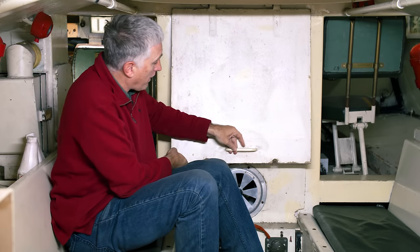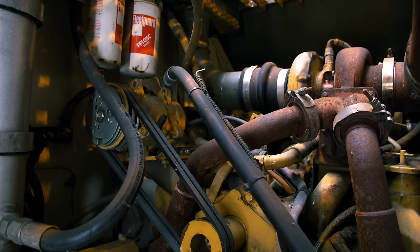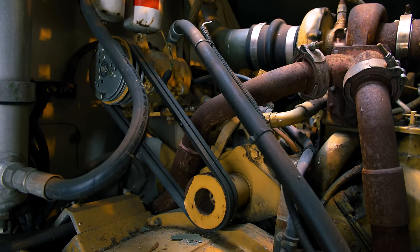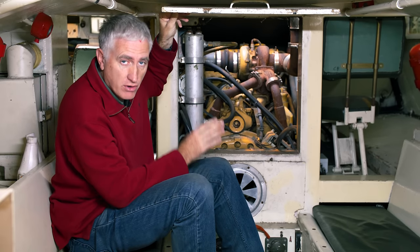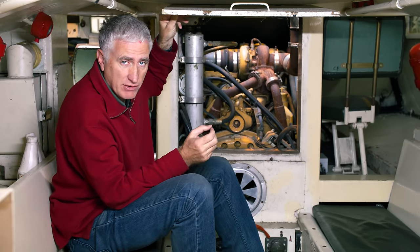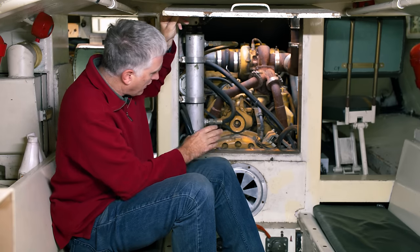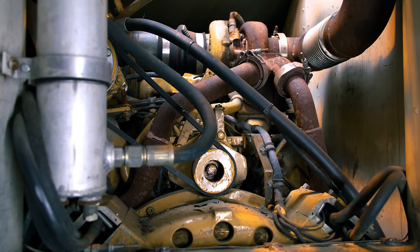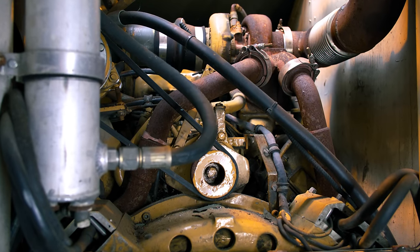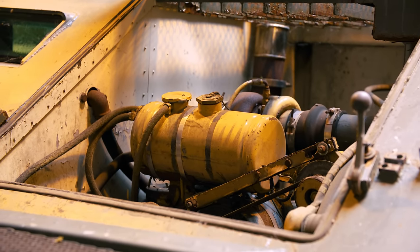The engine is at the front center. Under here we have a Cummins VT378C — it's a 378 cubic inch, six-cylinder, water-cooled diesel constant speed engine. It runs at 3,200 RPM. There is an idle setting if you need to drop down the speed a little when you're doing nothing, but if you're operating the vehicle it's 3,200 RPM. That attaches to the alternator, which would ordinarily go where the flywheel is, and that puts out 110 kilowatts at about 600 volts. I note the traditional yellow color that Cummins puts its engines in. Intake at the top, exhaust at the top.